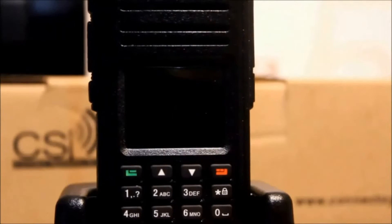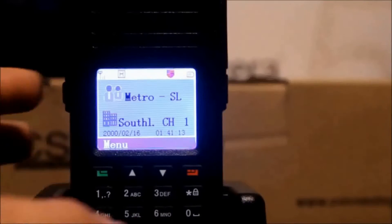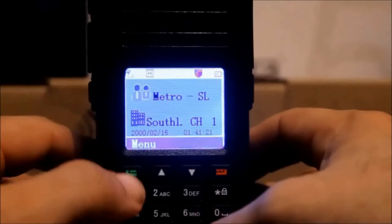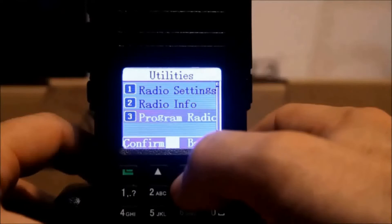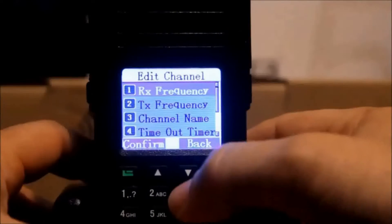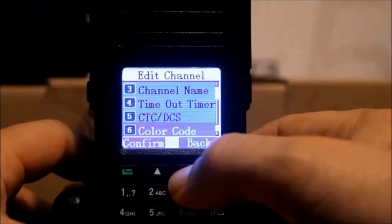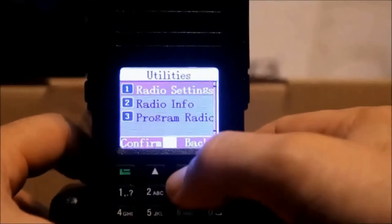So it is and it isn't, because you have to have the software and shoot the code plug in there to turn it on. By itself it's not FPP, but once you turn it on it is FPP — except I found that it actually does not work. I'm guessing this is going to be fixed in a firmware update. If I go into the menu and scroll to Utilities, the third option — which is only there after you check that box in the software — is Program Radio. You've got all your settings: RX Frequency, TX Frequency, Channel Name, Timeout Timer, CTCSS, DCS for analog, color code — which is basically the CTCSS tone for digital — and repeater slot. Seven different options, front-panel programmable.